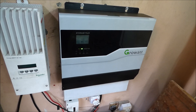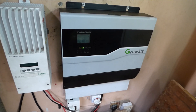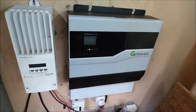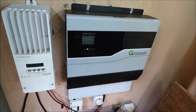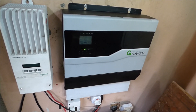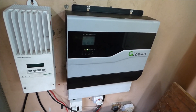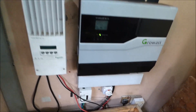For flooded batteries, the time it determines is very poor. The final issue we don't like is the maximum voltage you can set for battery charging — on this inverter it's 57.4V, which is unacceptable for flooded and AGM batteries. We need at least 58 to 59V, and for an equalization charge we need a minimum of 60V. This inverter doesn't give you that option, nor does it provide a hard cutoff for traditional lead-acid batteries.